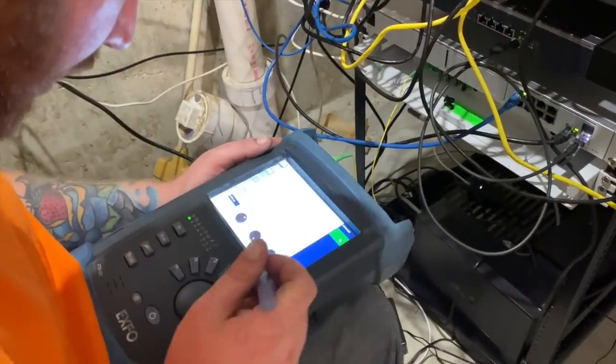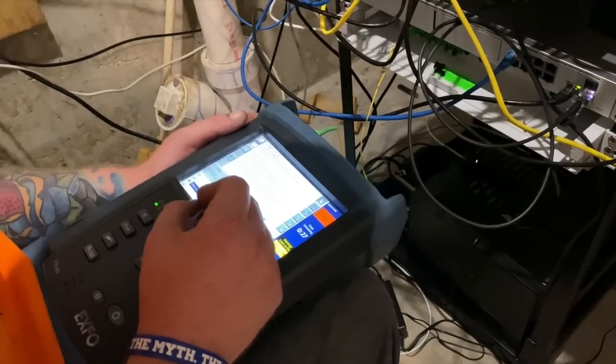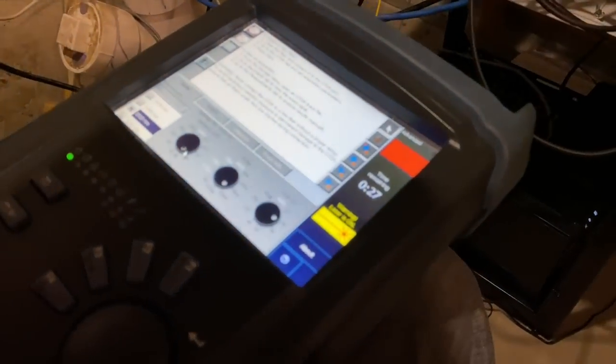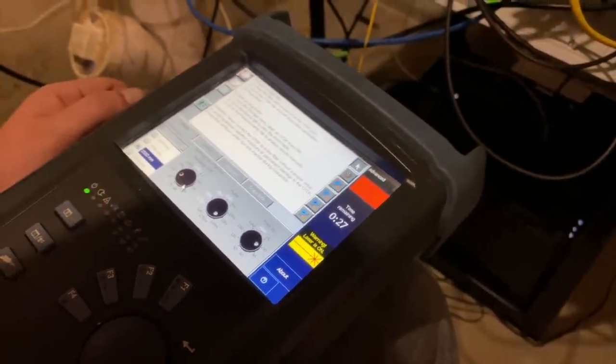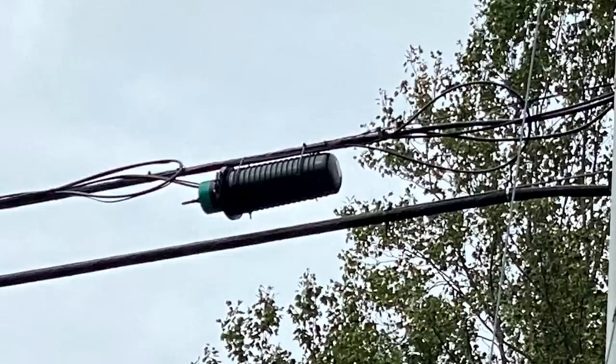After he was done with all of that we tested the two strands going out to the road and everything seemed to be good to go all the way back to the Comcast equipment. We're just waiting on the Comcast component to come in to get the rest of this job completed. That process took about 30 seconds and he was shooting lasers all the way down the wire to the other end. The splicer connected the cable inside the house to the street cable on the pole inside that canister, and he said the canister is a CWDM — a fiber optic multiplexer. Inside the house I've got one strand of fiber for receiving data and another for sending it, and I have a feeling that when it gets to that box it gets consolidated into a single strand with send and receive at different optical wavelengths. You can have different wavelengths of light on the same strand of fiber to make things more efficient, and I'm pretty sure that's what that box is doing.